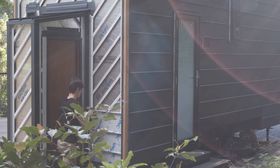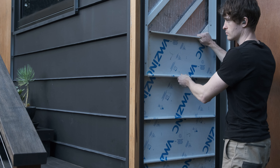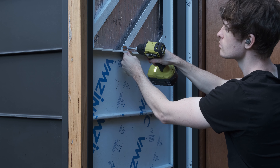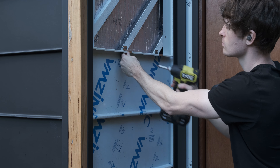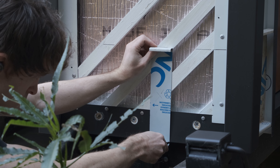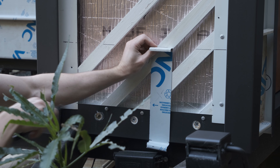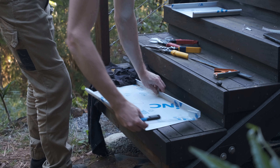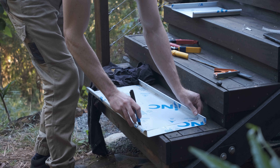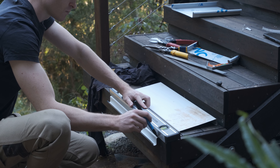Aside from looks, the main reason I've chosen this type of cladding is for its durability. Because the fasteners for the panels are not screwed through the panels but are instead behind them, this type of cladding is fairly long lasting and low maintenance. On a corrugated roof for instance, the screws that hold down the sheet metal leave many holes and eventually the rubber or silicon washers around the screws tend to go bad and need replacement. Whereas with standing seam, there are no holes in the surface to worry about.